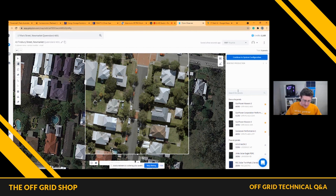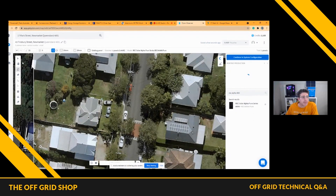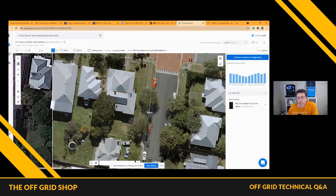Let's grab some REC Alphas — they're my favorite solar panel at the moment, the REC Alpha 400 Pure. These are lead-free and they're an amazing panel for the value. One thing I'd highly recommend when you've got someone doing a design and quotes for you: get a couple of different panel options so you can really see the difference in price. Everyone uses a fancy, flashy inverter, but in my opinion, if you're on a budget, I'd put a cheaper inverter and really good panels. Because if an inverter fails, it's going to cost you a thousand bucks and an hour of someone's time to fix it. If it's panels, removing them and all that is a lot more time and money. So put the best quality panels up — if you want to save money, save it on the inverter.